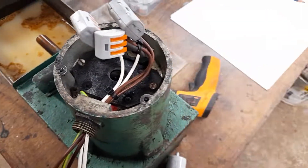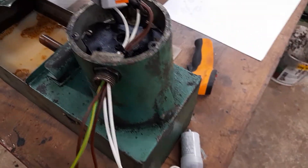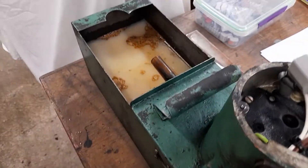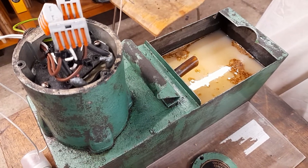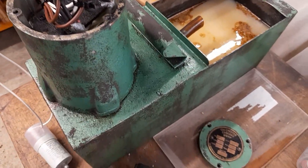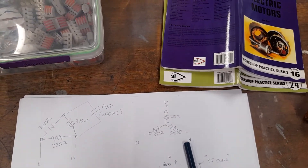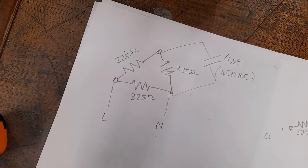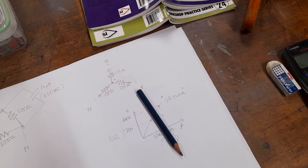I need to do a little rewiring to tidy things up — at the moment my mains is just coming in on two brown wires, which isn't ideal. I need to use UK colour-coded wires, and I need to put the capacitor in a box — ideally IP-rated given the proximity to fluid. But if I wanted to use this as a coolant pump I'd be perfectly happy running it on single phase from now on. If you have any questions about doing conversions, feel free to leave a comment — and please subscribe. Thanks very much for watching.